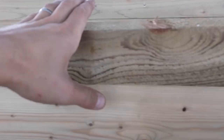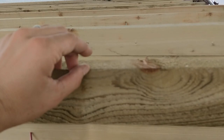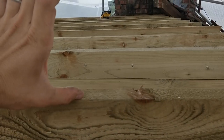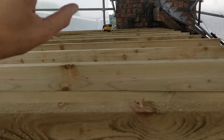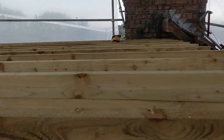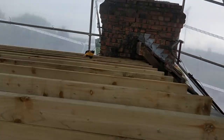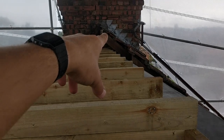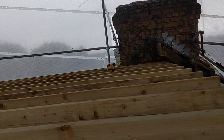The first one that we put down on here is an 11mm sheet of OSB. Once we've done the 11mm we put 120mm of Kingspan, and then we put the 18mm skin of OSB on the top of that, and then there's the rubber roof system. But that explains why we couldn't have this steel beam all the way up at the top where the original ridge beam is, because it would obviously be way too high.